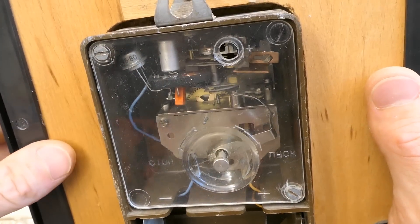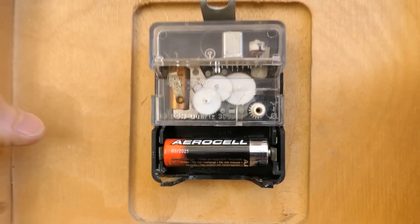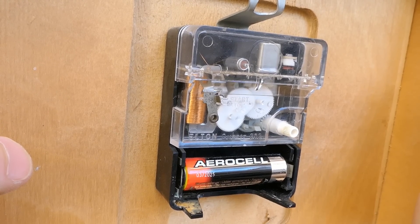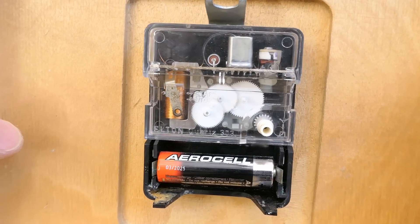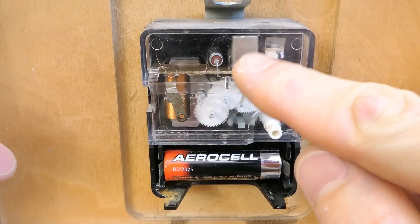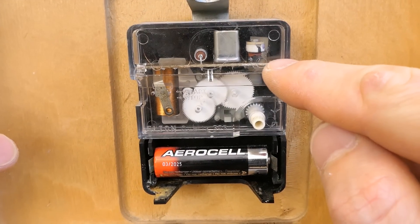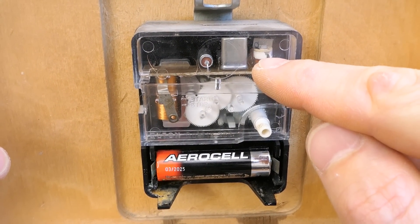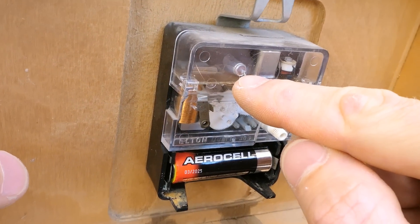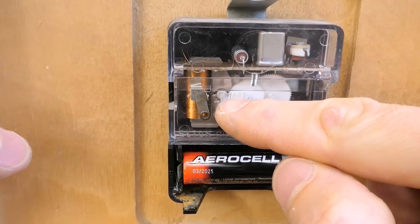And the third, the last evolution stage of battery-powered clocks would be the crystal controlled clock. And this is how analog clocks are made to this day, but here is an older example, probably from the 70s or 80s. You can see the big crystal here, there is a through-hole chip in it, an 8-pin chip, an adjustable capacitor to adjust the speed of the crystal — you don't really see this nowadays — some old electrolytic capacitor and a big coil as a part of this synchronous motor.